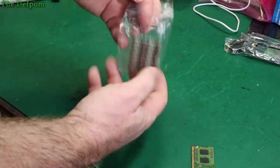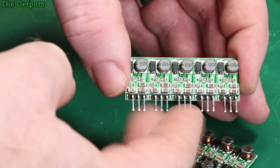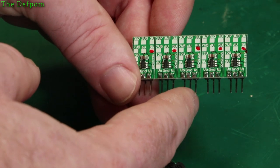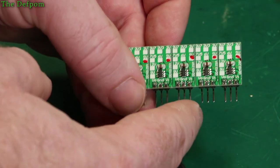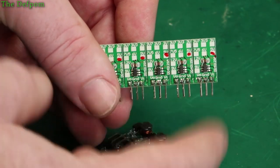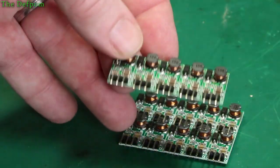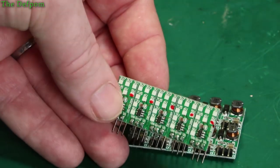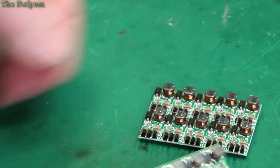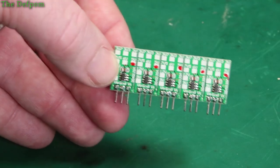These are voltage regulator modules — little switch mode buck converters. 5 volt supplies. These basically replace a 7805 regulator; the pin-out is based on that. So you can drop this into that position and use it as a little switch mode supply — much more efficient than a linear voltage regulator. These ones are rated at 5 volts, nice and compact. I think these are rated for 2 or 3 amps. There'll be links for these down below. And the other ones are 3.3 volt regulators. So I've got both types — 5 of those and 10 of those.